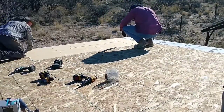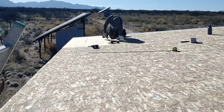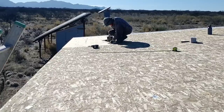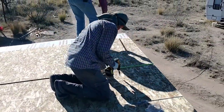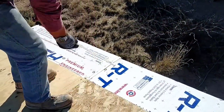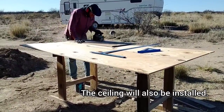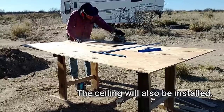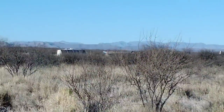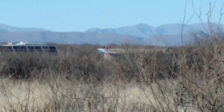It is interesting to note that even though this roof is very low cost by conventional standards, it will still end up being the most expensive part of this house. While designing it we were focused on keeping costs low while achieving the necessary functionality. The functional requirements for a roof on this type of house are different than on a conventional home. We can focus less on R-value since the massive amount of thermal mass in this house will pretty much take care of temperature regulation. In this roof we wanted to focus on light reflection by putting on a metal reflective roof and providing a good thermal barrier with a modest amount of R-value. And here is a view out of our kitchen window — we can just barely see Kyle's house from our place, with Kyle and I up there working on it.